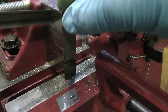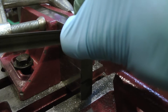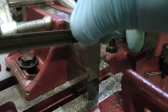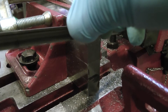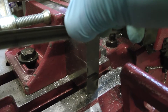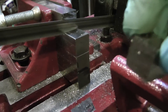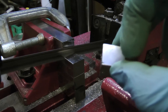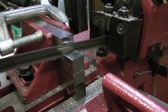I'm just individually taking the cubes off as they cut, just so they don't fall down and get dinged or something. I'm also trying to keep track of which cubes come from which bars so I can keep them together — for when I clamp them in the vise in future operations, I know that they're all from the same bar, from the same cuts, so they're exactly the same dimension.